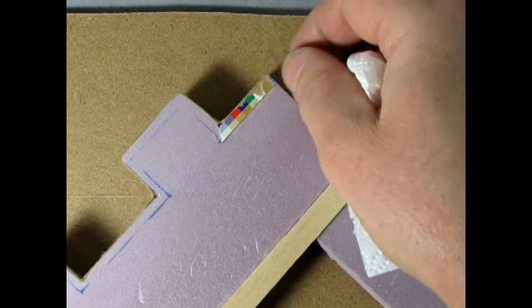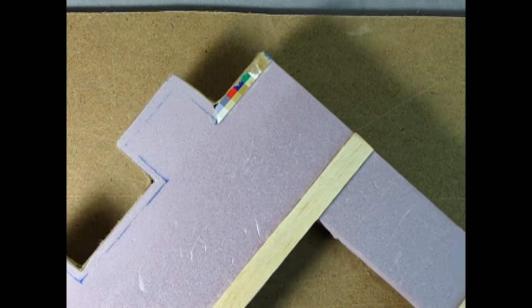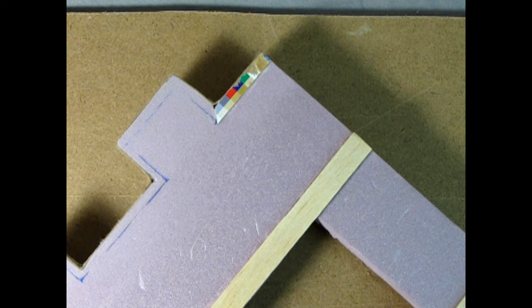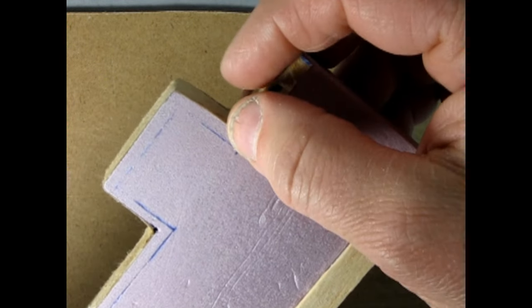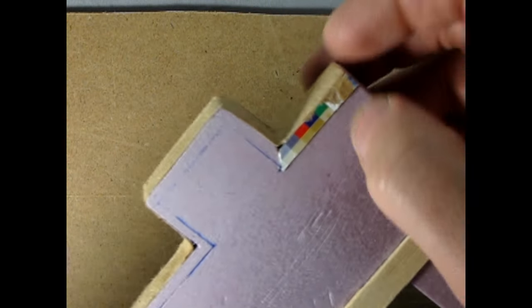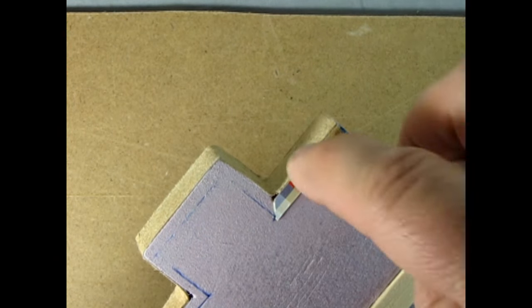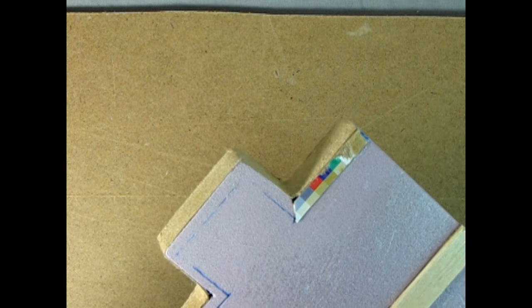And that should be just like that. So you see how easily that just glues down. And of course, carpenter's glue will take about 24 hours to completely cure. But it's pretty well on here in a few minutes, just depending. And then keep that toilet paper handy and watch that nothing is squeezing out along the tops here for glue or along the bottom, but you can always wipe that off with that toilet paper.